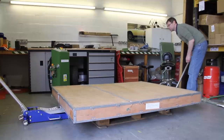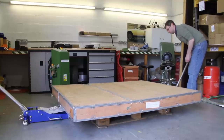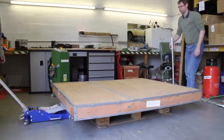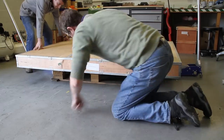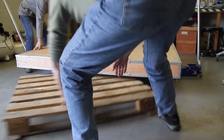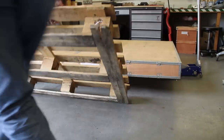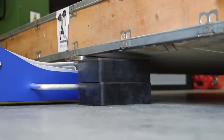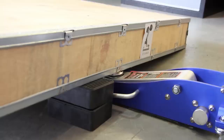Raise the lift packing case off the pallet. Watch out as we remove the pallet — keep the packing case balanced. Using the rubbers which came from the pack itself, place these next to the trolley jack and lower the unit onto the ground.